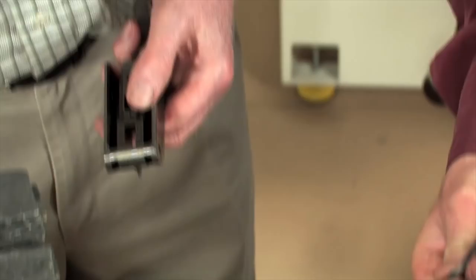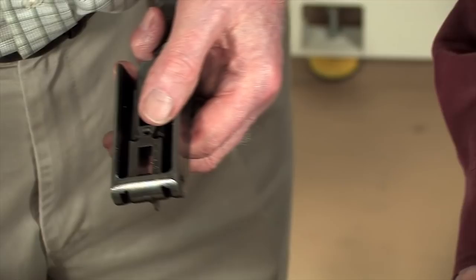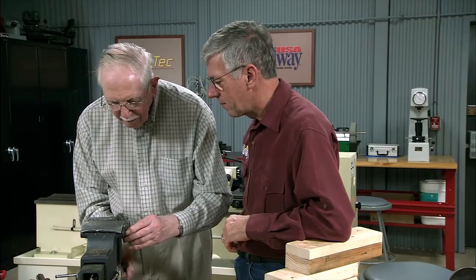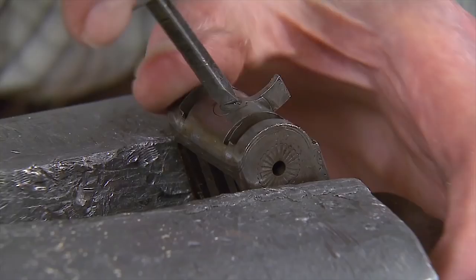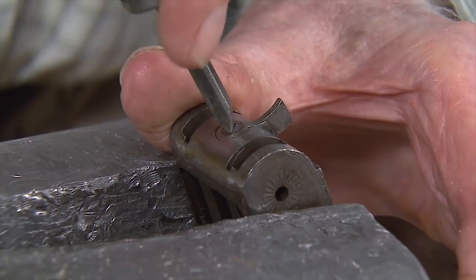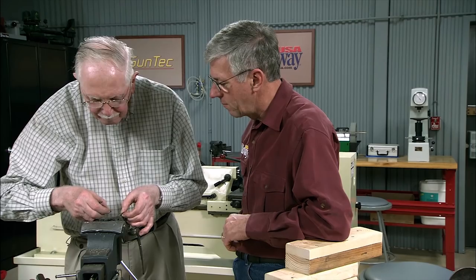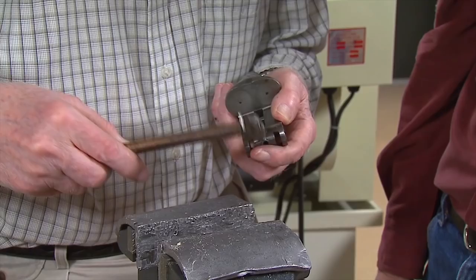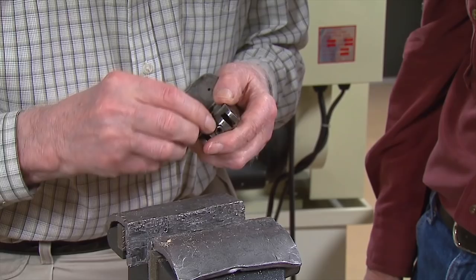Americans always mark the right. No, the Europeans mark the right. This is your action completely stripped out, except we'll have left the cam in. Okay. We can take the cam out dead easy because just under the screw pin — there's the pin. There we go — that's the cam out.